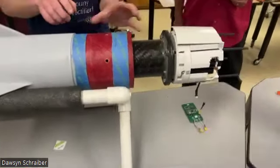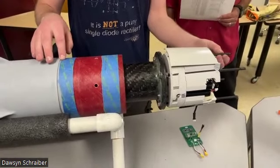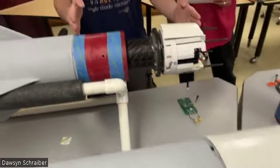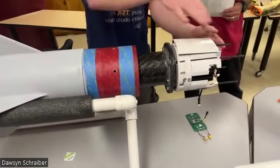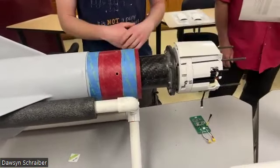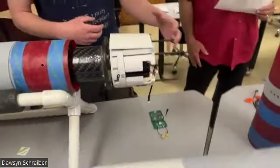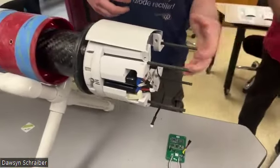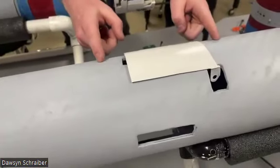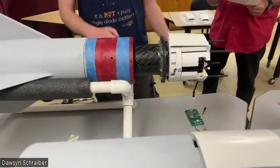You see this coupler here is 1 caliber, but all the way up to here is part of what helps keep this in the rocket. So I like to think of it as a coupler that's about this long, because you can count this assembly here as being part of what is actively holding those 2 panels together. Yeah, there's a bulkplate that goes up on top here, and this gets clamped down around the coupler that's epoxied in here that I mentioned earlier. So it's all pretty hard restrained all the way up through this assembly.